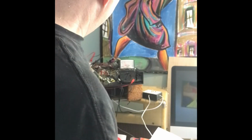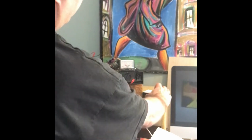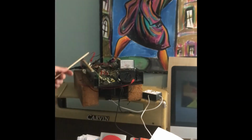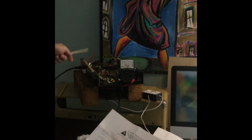Okay, so looks like we could bias this just a tad bit hotter. It's like I got it a little bit cool. Not a match set. That's fine. Now, that's this method. We would adjust this to 75 using the reading across the standby switch.